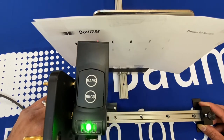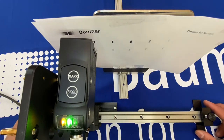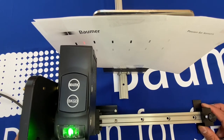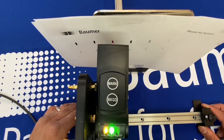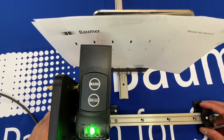The response speed as normal is 33 microseconds on and off on our registration marks. The sensor can deal with plus or minus 3mm of movement — if I move the sensor back a little, you can see the output still turns on on the registration marks. It has a jitter of 25 microseconds, so very good and very repeatable for mark detection.